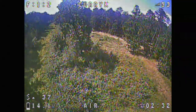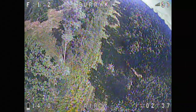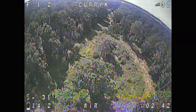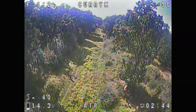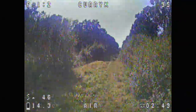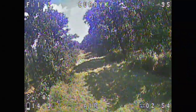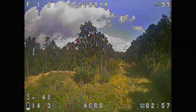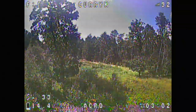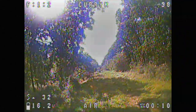To really get max speed I'd need a bit more camera angle, which means changing how the VTX is installed — it's the only bit of the build I wasn't happy with, a bit haphazard just fixed to the back of the camera. To get more tilt I'd either need to make the camera mount taller or move the VTX somewhere else. But not a bad first 4S flight overall.